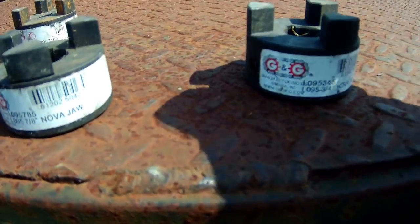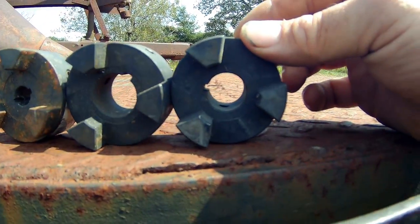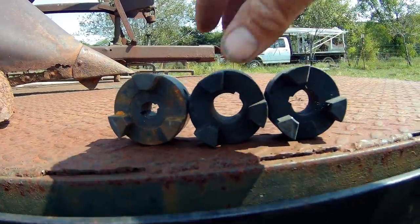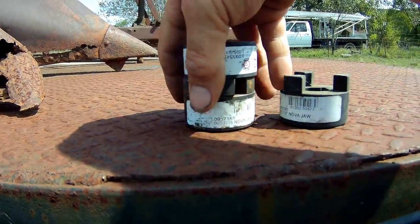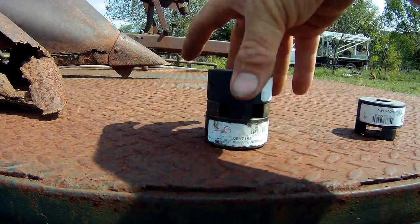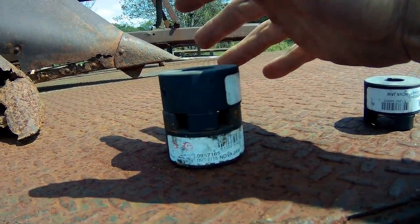This one's three-quarter inch, this one's seven-eighths, and this one is seven-sixteenths. You can see — let me line them up — quite a bit of difference in size between them. So you've got all three different sizes: three-quarter, seven-eighths, seven-sixteenths. That's how you bolt different shaft sizes together. There's a little rubber spider that goes in between the two — it keeps the vibration down and locks them solid together, but still gives a little give. And notice they're the same outside diameter, so you can mix different sizes.